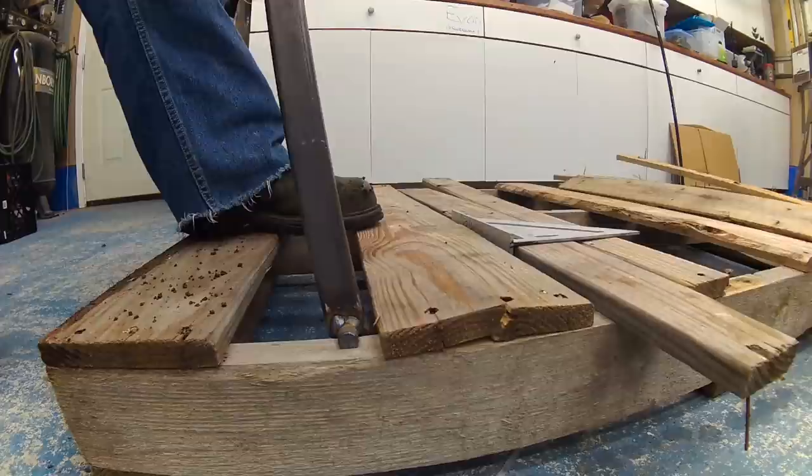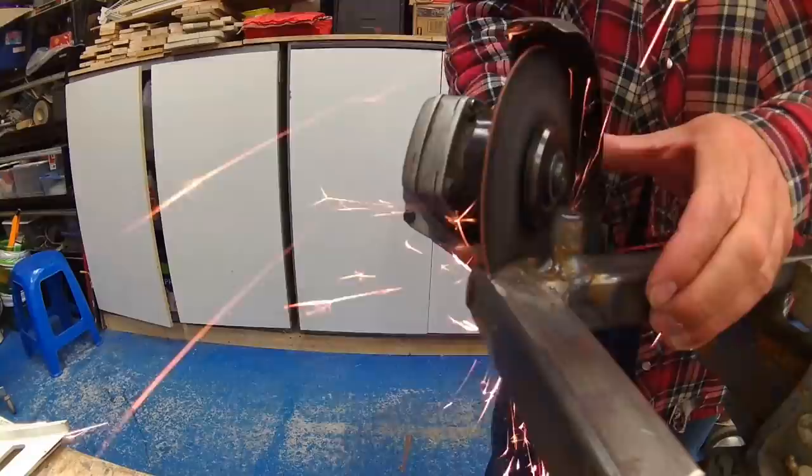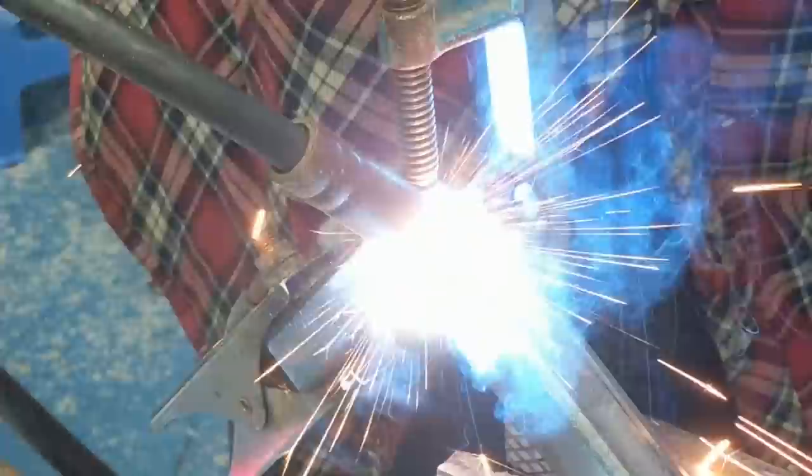Here's one of the flaws: on some pallets they're really narrow and my pry bar had trouble getting in. The other flaw is it was too short for the five-and-a-half-inch wide boards, so it just cracked them a little — really disappointing. To fix the first flaw, I cut the corner of it and welded another piece to fill the gap.